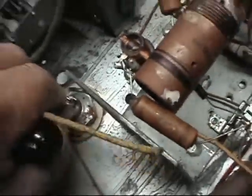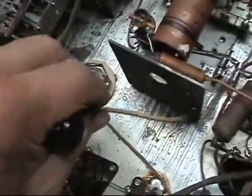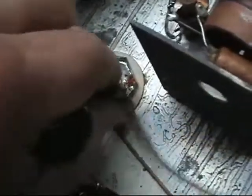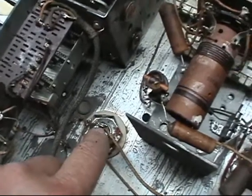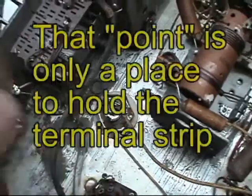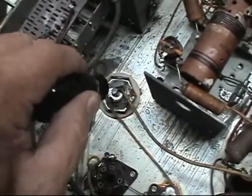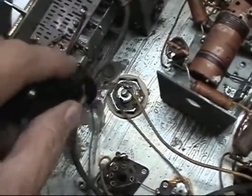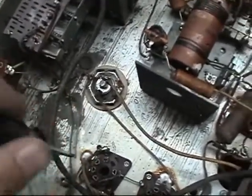Remember me telling you that what I do is use these as tie points. What I do is take off the center wire, which is already disconnected of course — that would normally go to your electrolytic and your filter networks and so forth. I disconnect that, and at that point I solder my center ground lug from my terminal strip, which I'm going to use to mount the electrolytics, to this point. On this type of radio, there's plenty of room so you could mount the terminal strip here and just electrically take this out of the circuit.